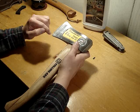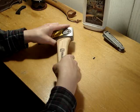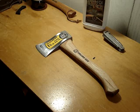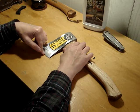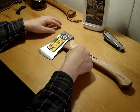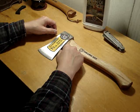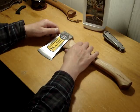It seems to be fairly hard — like it doesn't file terribly easy. I just used the stone to try to polish the edge, so it's not super sharp. But I didn't want to go crazy on it until I got a feel for whether the steel is soft or too hard. Sometimes if it's a bit softer and you put too fine of an edge on it, it just rolls if you hit something hard. I was cutting up random branches and splitting chunks of boards from pallets into kindling. There were a couple chunks of locust branches, which are actually quite hard, and I hacked through them pretty easy.